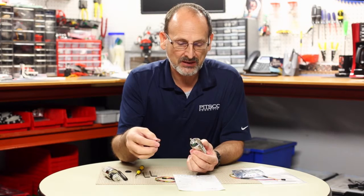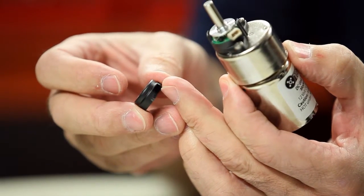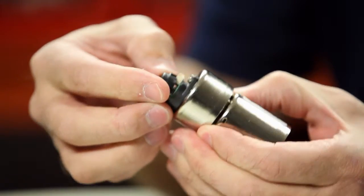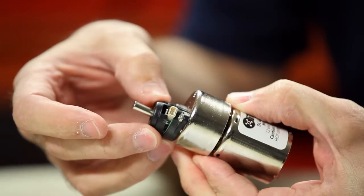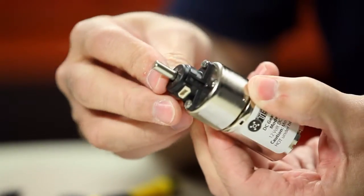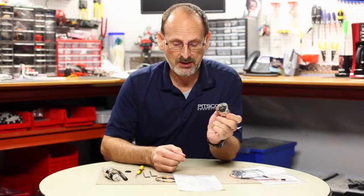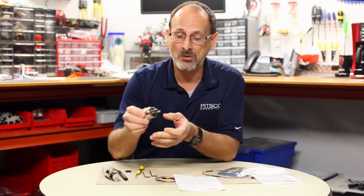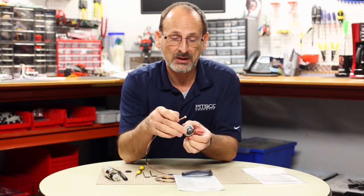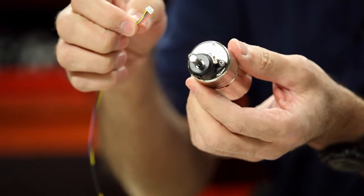Now that I've got the encoder pushed down in place, I'm going to take my cap and make sure I notice that there is an opening for the cable connector. I'm going to carefully put that over the shaft of the motor, making sure that the tabs are lined up. Quick note of warning: once you get this in place, it is a little bit tricky to get back off, so make sure it's where it needs to be. Then just snap it down in place. Make sure the tabs are engaged on both sides and your encoder is mounted. The last thing you do, once you put it in place on your robot, is mount the cable onto the cable enclosure and you're ready to proceed.